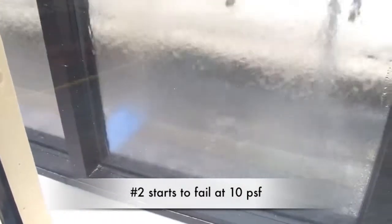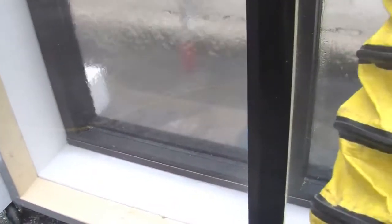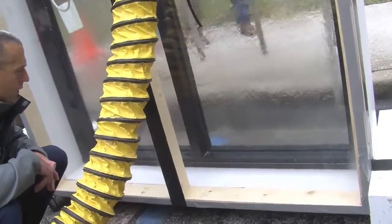What's happening is 1.92 is the column inches of water — it's trying to pull two inches of water into a pan that's only one inch high. So unless that joint between the pan and the storefront is perfectly sealed, that column height of water is going to come over the top. And this is the kind of leak you would see in the real world in a storefront exposed to wind-driven rain. It's coming over the top of the pan here, with quite a lot of water collecting, and there's a glazing leak there also.